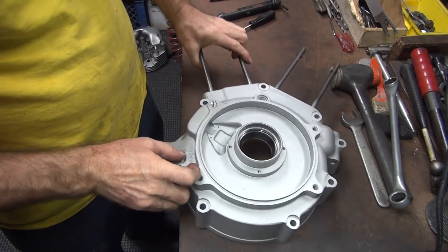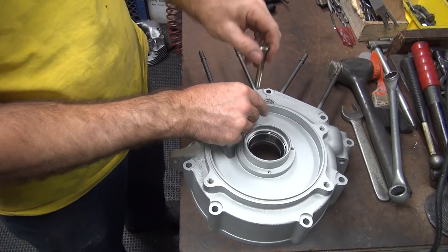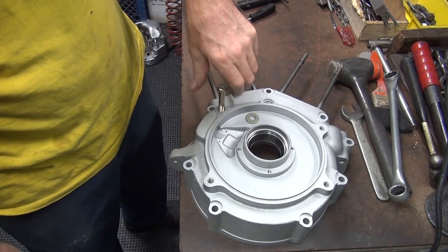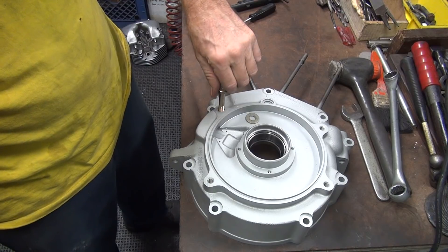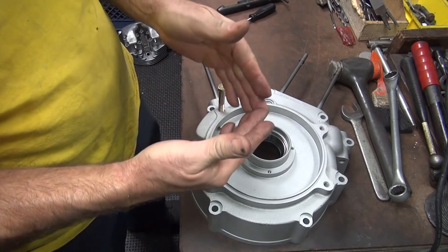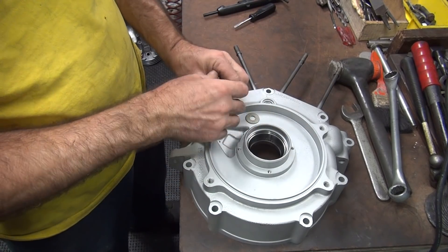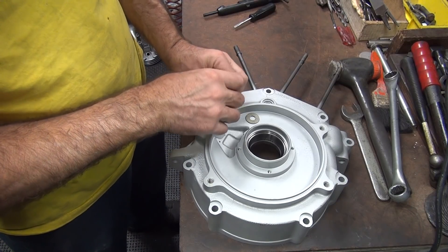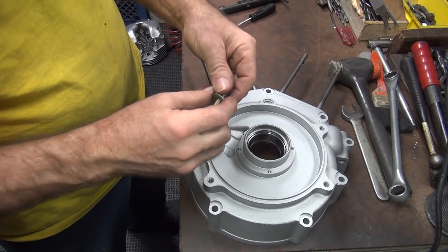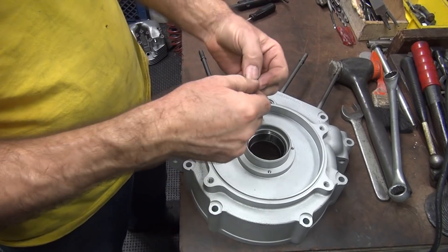So now it's in there. Final test — let's put a bolt in there. Make sure it works. It should go all the way to the bottom of the hole. It's a hard stop; it's bottomed out. Now if you put the helicoil in there and it hits the bottom of the thread and compresses the helicoil, the bolt will lock up before it gets to the bottom. That's what starts tearing up things — it will actually tear up the end of the bolt.